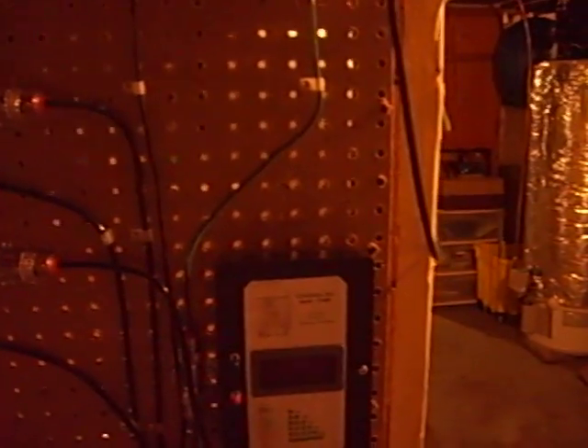I made a long lead for when I want to expand my bank above, below, and underneath. Here is the control panel — there are the AC-DC rectifiers. They're for three-phase AC motors I'm running. They sit on simple heat sinks: four-inch by four-inch 16-gauge aluminum with a tin shield behind that. Then 30-amp fuses down to my charge controller. There's my dump load — two-ohm resistors running 100 watts apiece.